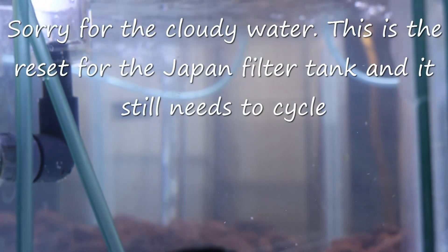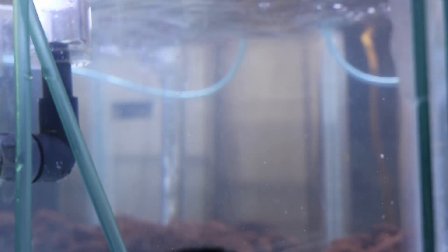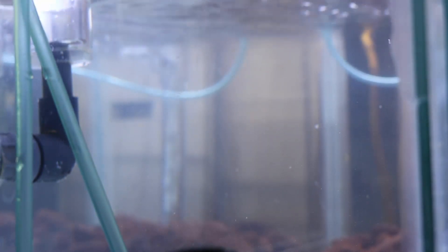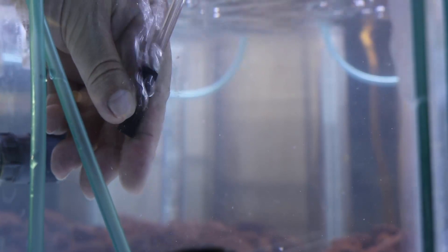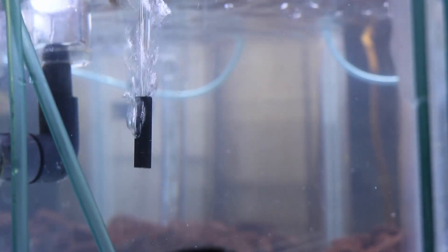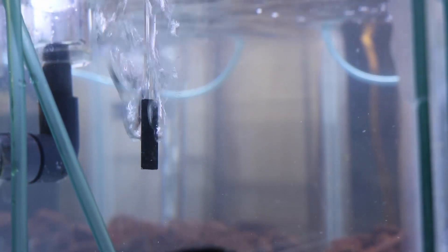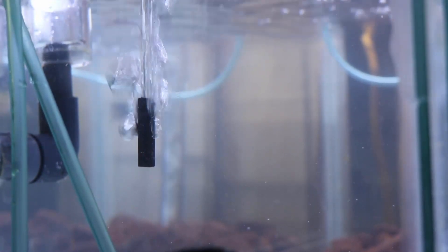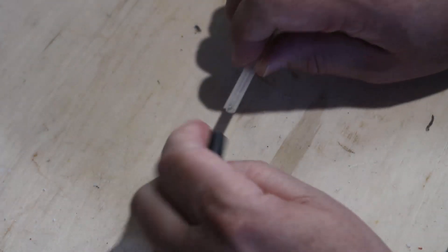This is one of those ideas that kind of gets in your head and you say, wow, this is kind of neat. It just takes two seconds on a lathe and on the milling machine, and this is the first result. I want to see what this would do. I'm going to stick an airline on it — it does actually give nice bubbles, but it's all pretty much the same. These are just two little holes; I didn't want to drill dozens of holes, I just wanted a quick check to see if this has any viability. And it's fine — there's nothing wrong with it, and it will not clog because you can just run a little piece of wire through those holes and it'd be perfectly fine again.